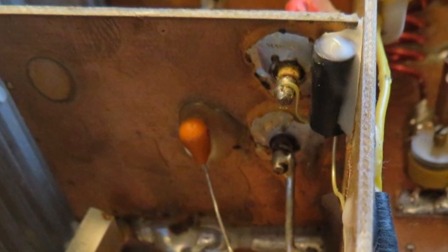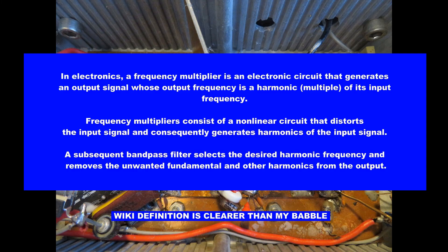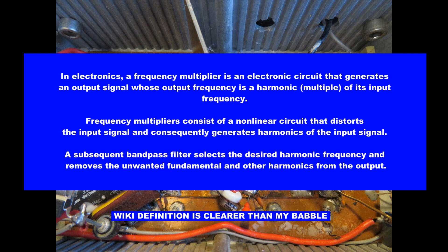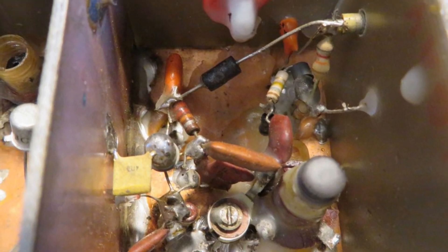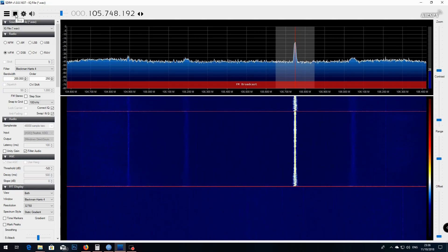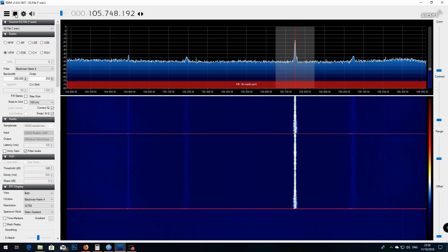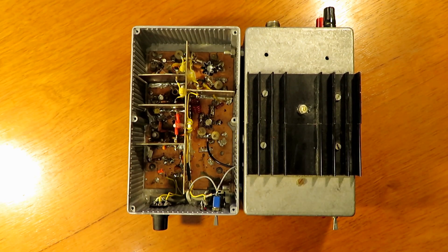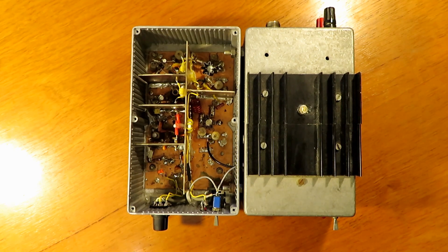Arthur's designs were based, as we saw in the first episode, on frequency multiplication. That way you can start off with a much lower - say 7 megahertz - oscillator and come out with your 105 megahertz, much more stable oscillation at the other end. The design was split in two halves: it keeps the separation between the front end and the power stage so that you don't get any feedback issues between the two.